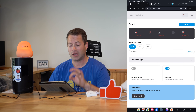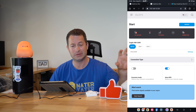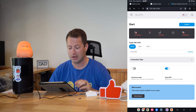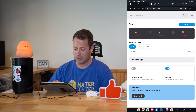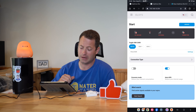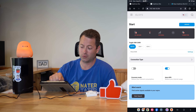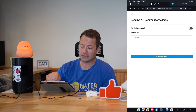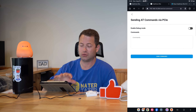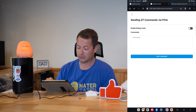I've logged in by going to 192.168.10.254, which is the default address for this Elsys unit. You can see there's no SIM card in it and no signal, which is expected. There are some settings I won't go through all of because I have other videos covering those, but there's a special address - you have to add a slash 'send AT command' at the top - and that gets you to this special page that allows you to send AT commands to the unit over ethernet.